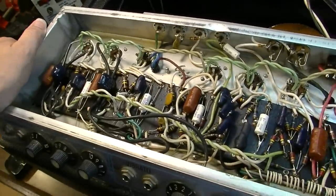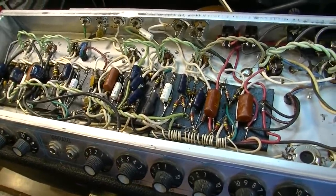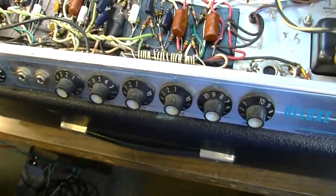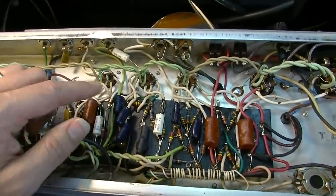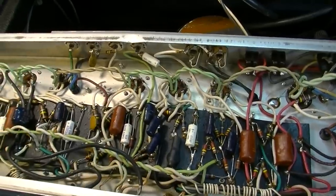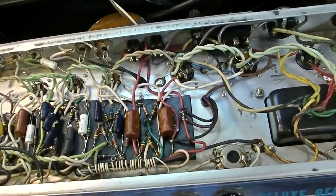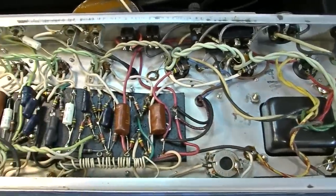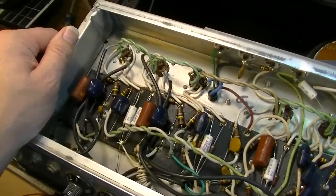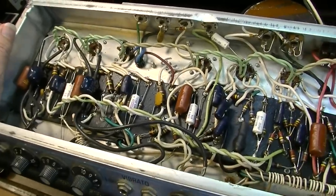But if nothing else, we'll check the tremolo, and check and see why the reverb has some intermittent noise. He said it had intermittent noise. Clean the sockets, clean the pots. We will also see if the tubes themselves, on the tube pins, sometimes those are kind of corroded, and we'll have to clean the tube pins a little bit. And that's a very common point of failure on these as well. A lot of times you get intermittent problems from tubes and tube sockets because they're not getting good connection, because over the years they've just oxidized. So you have to clean those.